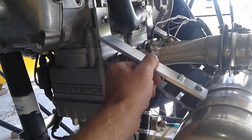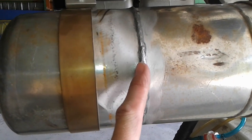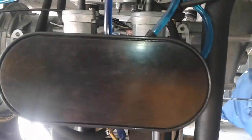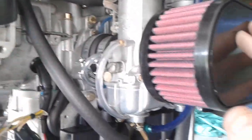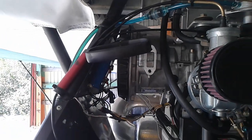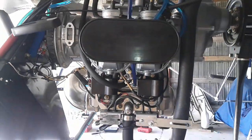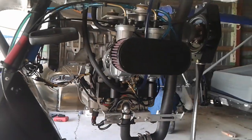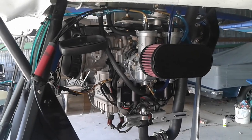There are some custom exhaust brackets, again built by Scott of Palmer Fabrications. This is actually the exhaust off of the Chinook — Scott had to cut it open and re-weld it to get out all the bits from when the 582 on the Chinook blew up. Dual Bing 54 carbs on this side with a single air filter, dual ignition, and pull start. I like the pull start — it's simple, it doesn't add weight, and you don't have to worry about a bigger battery, solenoids, relays, switches, or keys. Just flick the ignition switch on and pull until she starts.